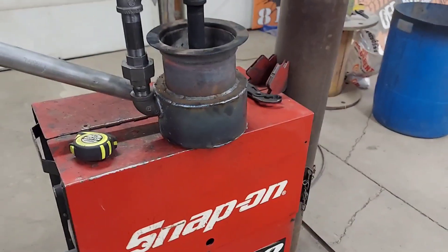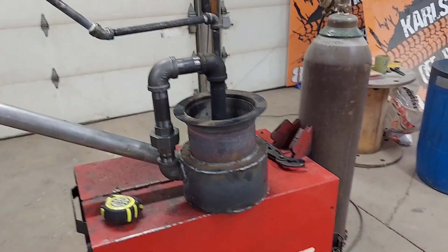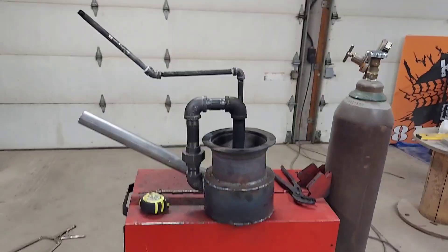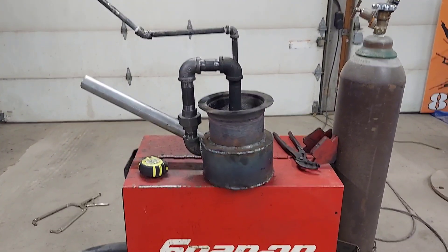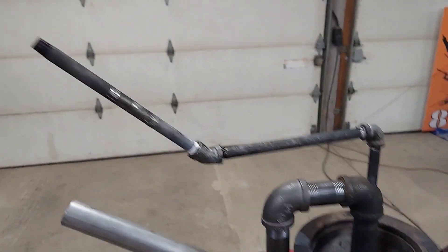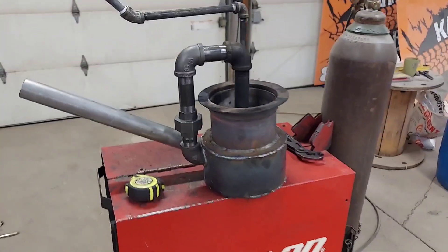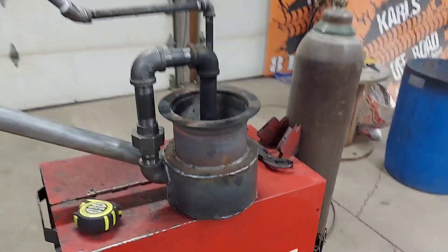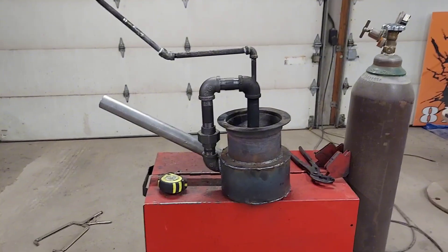I'm going to do a test burn on the floor here. I originally was going to mount it in my boiler today but I'm going to do some testing first because I don't want to put it in there and have it go out overnight — I run my boiler 24/7 and I count on it for heat. So I'm going to set it down on the ground and do a test fire to see if this heat reclaim and preheating the oil makes a difference — a quicker light or a better burn. If I don't get the results I'm after I might pull this back out and drill a few more holes. It's all just testing and trial and error.